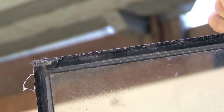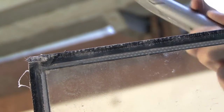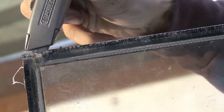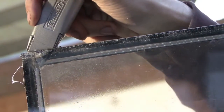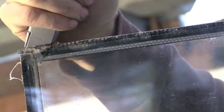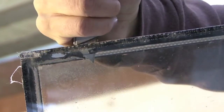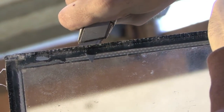Some of the older double glazing panels are harder to get into, so if possible, try and get a slightly newer one. Basically, you want to get a Stanley knife and get it in between the top pane facing you and the rubber metal casing that separates it from the bottom pane. You should be able to see the blade coming through. Once it's like that, you just need to start to pull it slowly but firmly along, and you can see that you start to break the seal. Once you've done that around all four sides, you'll be able to get it open.